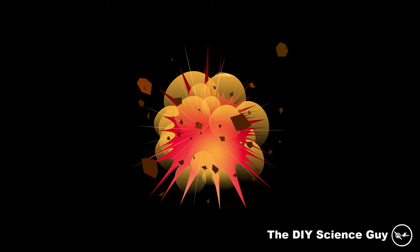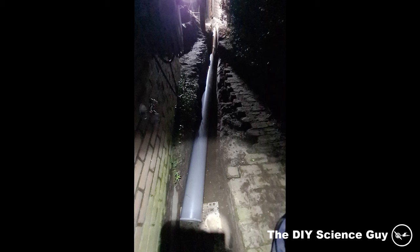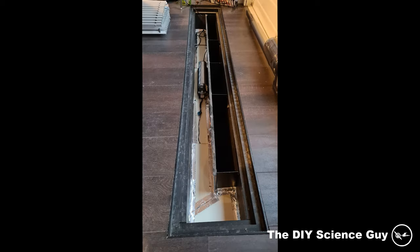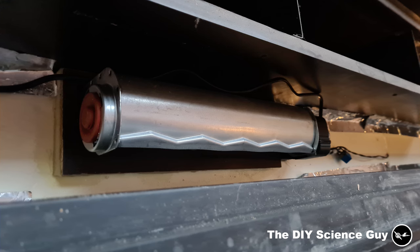For safety reasons, because I use propane, the heat pump will be installed in my workspace. All the pipes to connect everything together can be put into the big pipes I've installed in my garden, which connect the house with the workspace and the hot tub. I want to heat my house with 35 degrees Celsius water to increase the efficiency of the heat pump, and to do that I implemented blowers into my convection pits. With my current gas-powered heating that already works well, so it should also work with the heat pump — the blowers are turned on when the hot water is supplied to the convection pits.